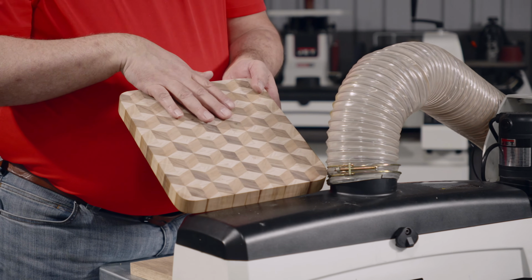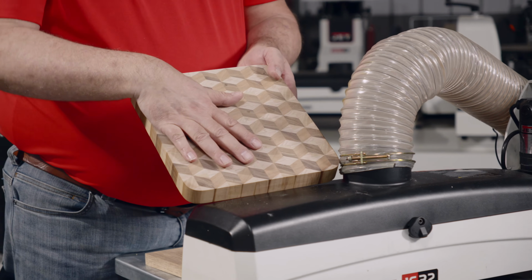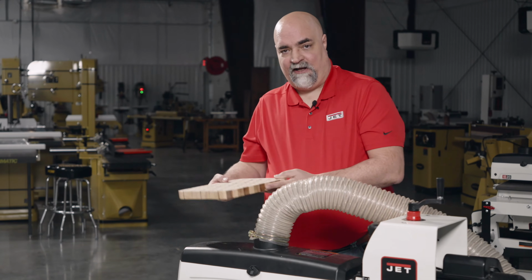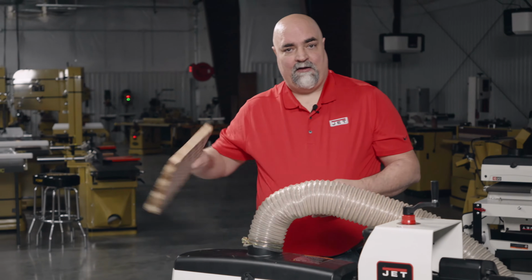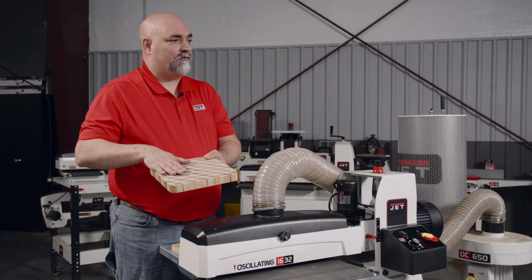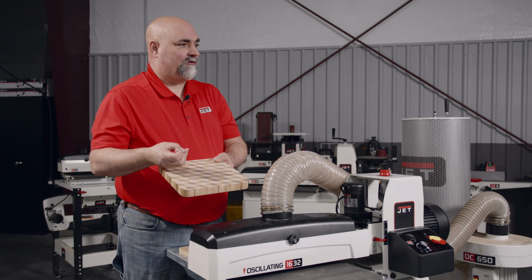When you're sanding end grain material, 1, maybe 2 passes is what you'll be able to do in a single setting of the drum. Take it out and set it aside. Make sure that you don't set it too long or in a very, very cold location, because that will distort the wood the other way.